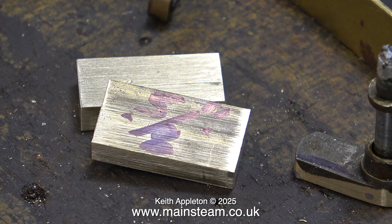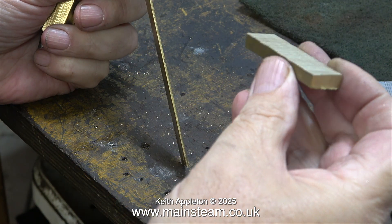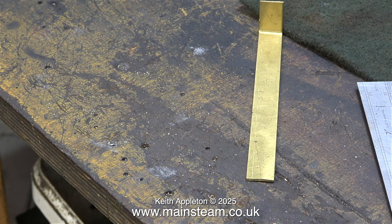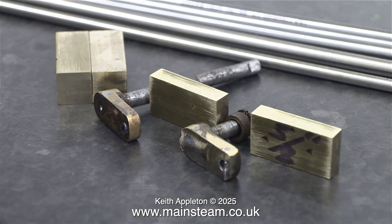It's time now to take these parts down into the smaller workshop in the house. This is where I'll be machining the crankwebs. I had a piece of brass left over from when I cut the second thinner parts — I just put it back in my box of brass bits. This piece of brass I'm going to also take down to the house, because I'll chop this up. It will be used to prevent the jaws of the four-jaw chuck from marking the work as I machine the parts.